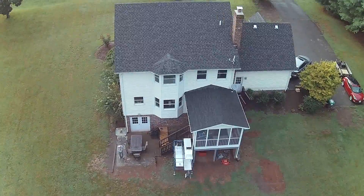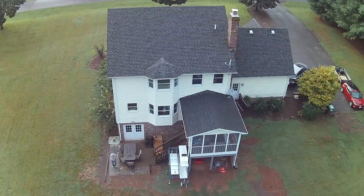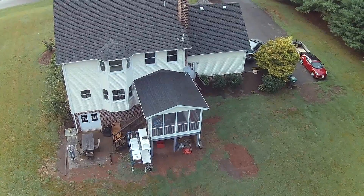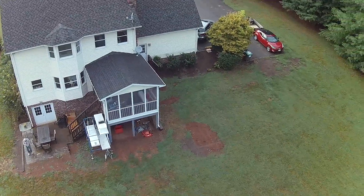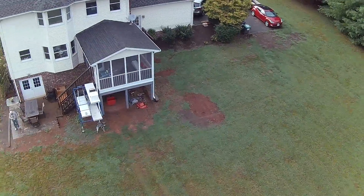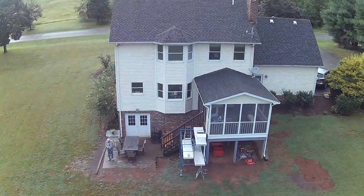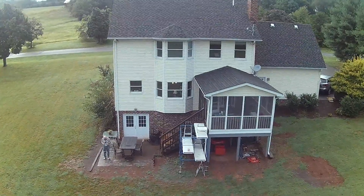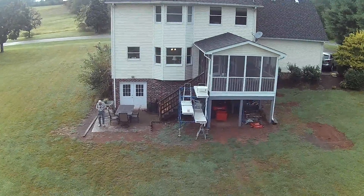Just a piece of information: I'm using 4000 mAh 3S batteries and the quad flies almost exactly 15 minutes on a full charge. I'm hoping to get something close to 20-plus minutes from a 5200. So there we are coming down and practicing positioning to get the house in the frame — moved the stick the wrong way, there we go again. That's going to take a fair amount of practice but I'm going to have to get the sensitivity and rates dialed in to make it easy.